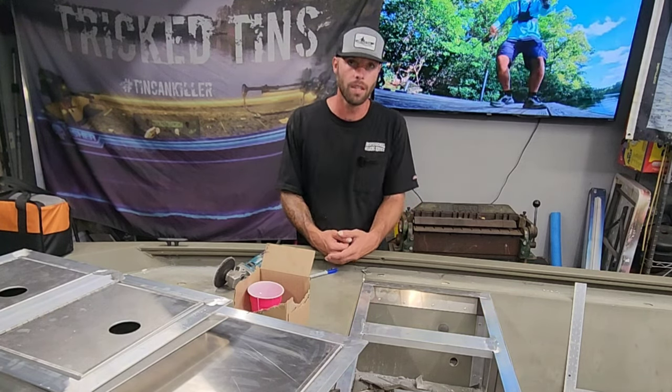What I'm going to do is put you guys back on the hyperlapse. I'm going to put both of these leveler pieces on the port and starboard. I'm going to run my angle across here for support and try to finish off my transom angles and get this whole back transom deck figured out and finished up. I'm going to install my bilge pump, run the wiring and stuff for that, and get ready to install these LED lights. Let's get back to work, guys.